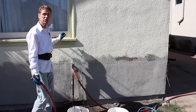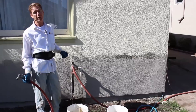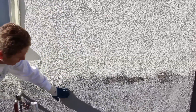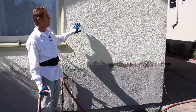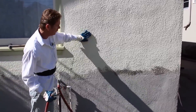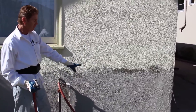Hi guys, Kirk and Jay here with Kirk Giordano Plastering. Got a question for you guys who watch what we do — can you tell the difference, or does the camera show the difference between this finish here and this finish here? What is this finish? You guys should be experts if you've watched any of our videos. This is a light dash. What is a dash? It's a thrown-on finish or a blown-on finish — you blow with a hand hopper or throw it on. What is this? It's a heavy float finish.